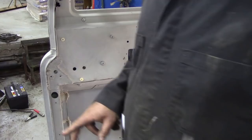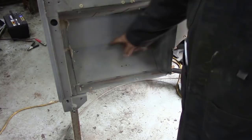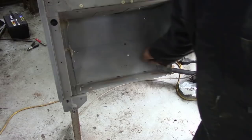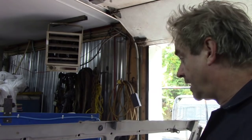Easy. Now, next thing. The footwell looks perfect inside and it is quite solid. So I'm going to cut here, cut across there, then cut down here and around this bit here, leaving the lip on these bits and making a drop-in piece which will have the same holes, and that's that done. But I'm going to make that out of 1.3 millimeter, and that should work fine. And then it'll be good to go back down to the blasters and work it out.